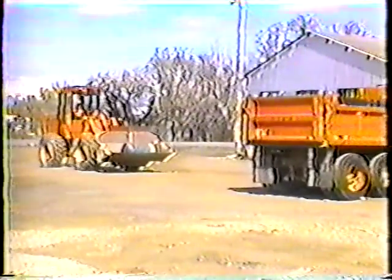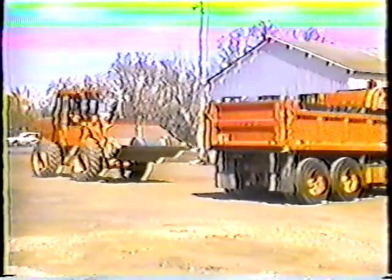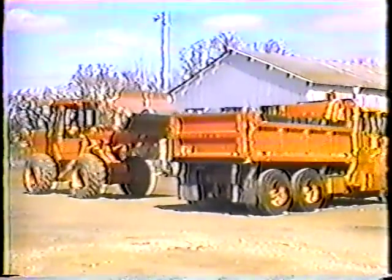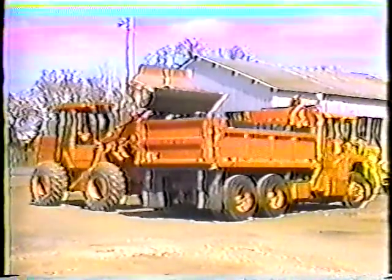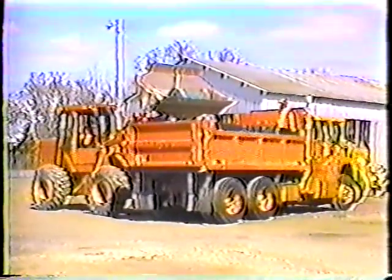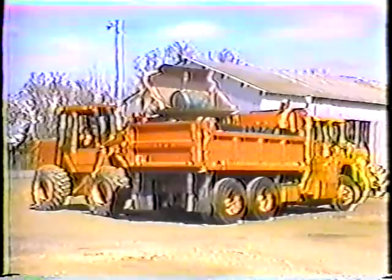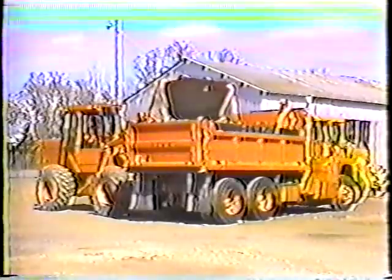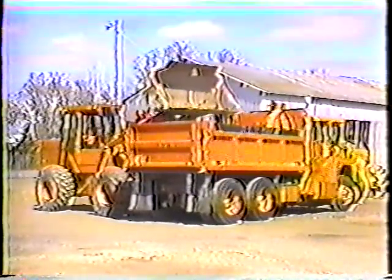While the signs are being set up, the truck can be loaded. If you have a divider device for your truck, use it. If not, place a barrel in the truck, because on this job the material has to be spread in a narrow path. By placing the barrel along the tailgate on the passenger side, you can spread the material right where it has to go — at the edge of the shoulder.